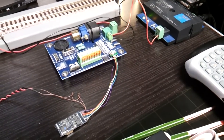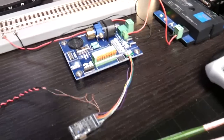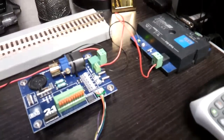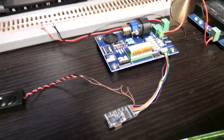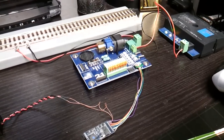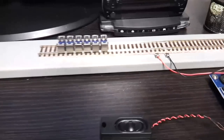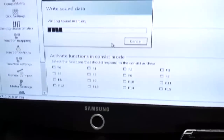Yeah, so I've got the chip wired up, or plugged into the ESU decoder tester, and that's in line with the programmer. So programming it up now, if there's any problems or faults with the speaker etc., I'd find out straight away, and just to make sure everything's fine before installing to the Loco, which I would then place the chip into and put on the programming track and play around with it using the ESU